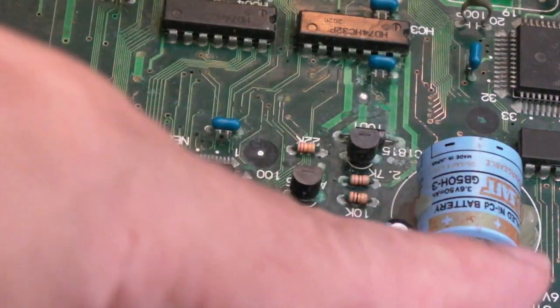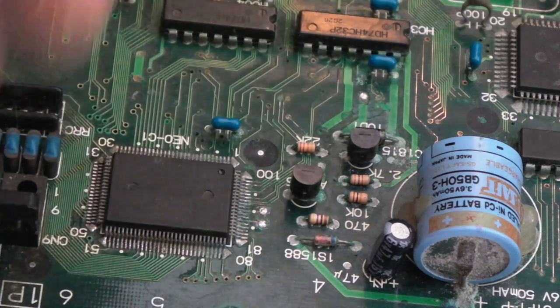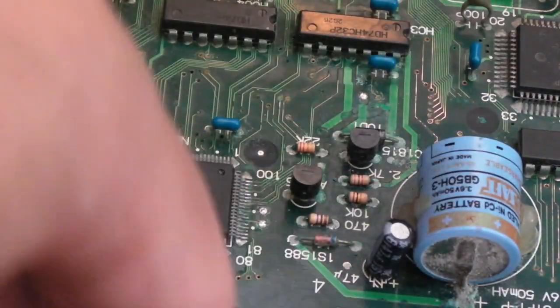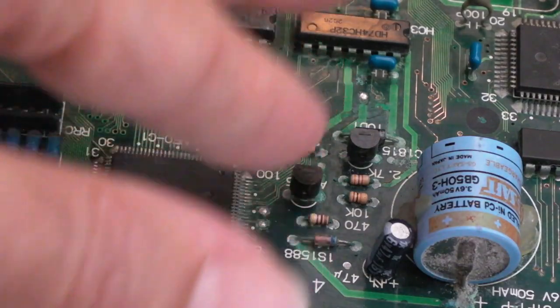I'm surprised, actually, at how few... Well, I've not found a single damaged trace yet, an actual break. All the ones I've cleaned up, they just need tinning, and they'll be good as new. The vias could be the issue. That might be what the issue is, that the traces all look all right on the top side, on the bottom side, but maybe we've not got a connection between the top and the bottom side